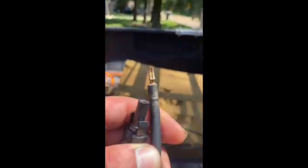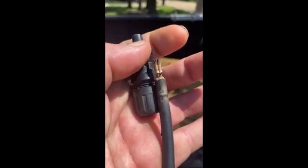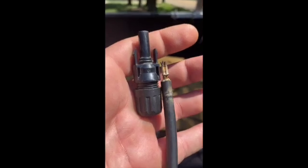What we found with the SMA arc fault is that one of our crimp heads was bad. So we're going to have to recrimp this head and add a new MC4 connector.